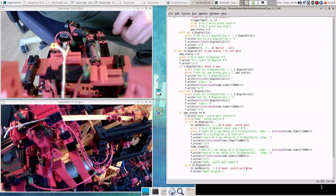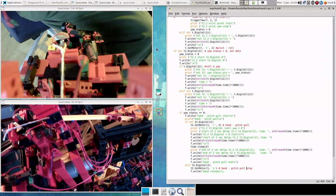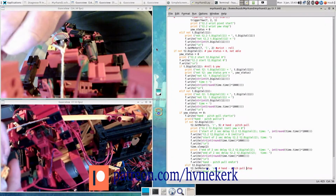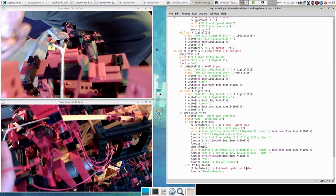And I can use a fischertechnik one or a real one. The real one has to be equipped with an additional resistor, which a fischertechnik one doesn't need. On the other hand, it takes more space to use a fischertechnik one, so let me check what I actually can do. But it seems like a good idea to me. And for now, I have decided to go with a fischertechnik LED, so add some wiring. So I'll put the LED here and have to reroute the wiring via the LED. So let's do so.